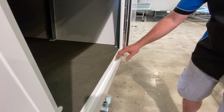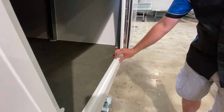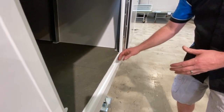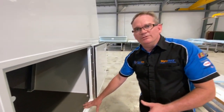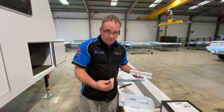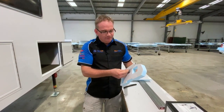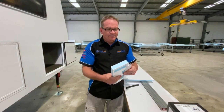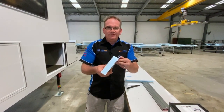We actually use the bottom piece as a Z-section and don't turn it into a C-section. In other words, we leave the back leg out when we're installing this. If you see here, when I talk about a C-section, we put the main door piece on and then turn it into a C-section with this drop-in leg, so the actual piece goes past the panel the thickness of itself.